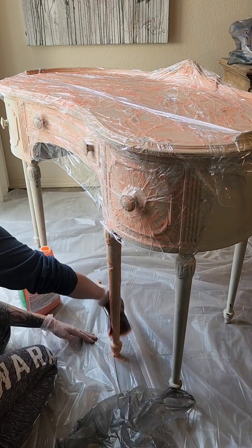The top of the piece had several spots where I needed to use a very fine needle with some wood glue underneath to re-glue everything down. Then I set some books on it for a couple of hours until it dried, and went and sanded the entire top. As everything started drying, it was interesting to see there were probably three or four different styles of veneer all over this piece — all the drawers were different, some of the backsides were different. It was a very interesting piece.